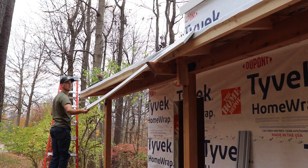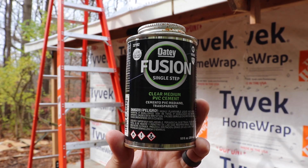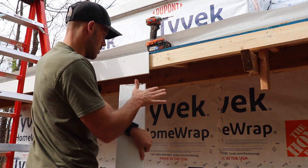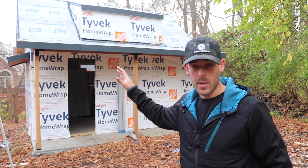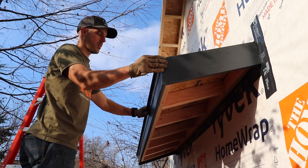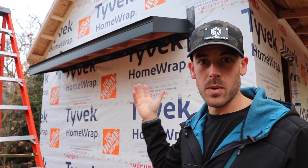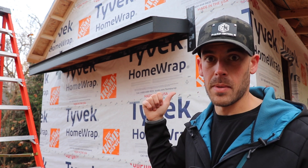Now for this long front porch edge, I just split it up into two sections of 12-foot boards, so I added a 22.5-degree miter to the mating joint to help hide the seam. I was told you should apply some PVC cement to keep the seams from coming apart, so I was a good boy and did that too — but then royally screwed it up as I tried to shimmy the trim board over. It's currently the next morning because, of course, that took way longer than I thought. But now that we've got all the fascia up and one coat of paint on it, we can start putting on the drip edge. And because I'm a roofing newbie, I'm going to start off on these little overhangs on each side of the shed. It just gets sandwiched between the fascia board and the underlayment on top. I can make all my screw-ups here so I can learn and hopefully not repeat them on the big roof.